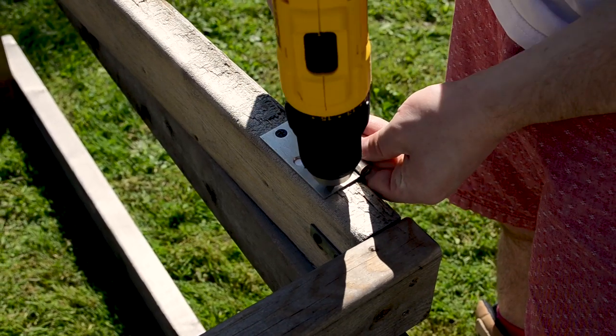The next thing is to put your hinges on the door. I would suggest putting the hinges on the lid first, before you put the screen all the way around, because the screen isn't actually attached at this stage. When you're flipping this thing up and down, if the screen door is already attached it's going to be a pain. So put the hinges on first, then we'll go to the next step.